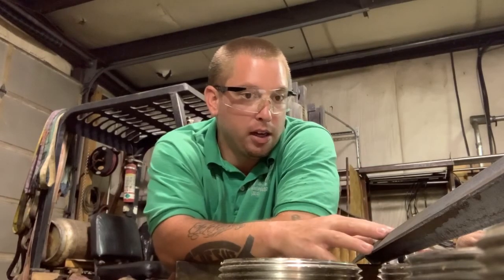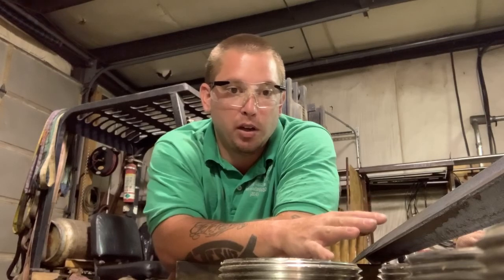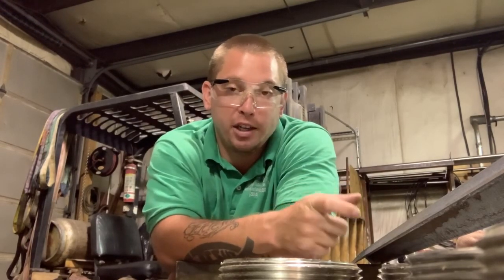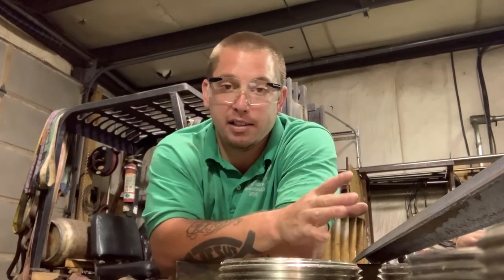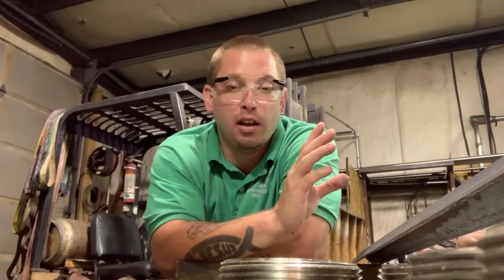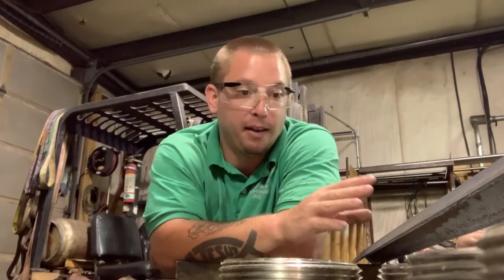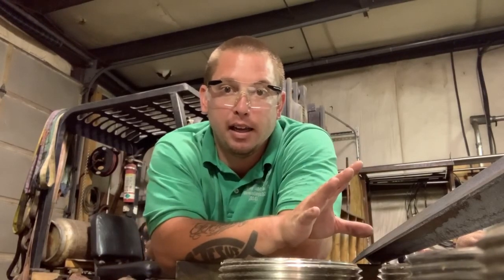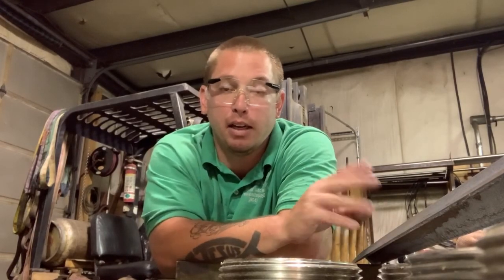And weld the top frame, the bottom frame, then get the legs cut and weld those on. Then we're going to have to make a plate for each leg to mount the casters on. I haven't gotten those yet, so that'll be the last thing. I'll have to get the casters and then see what tapped holes I have to do in that. After that, it's ready to paint, and once it's painted, we put the diamond plate back on, and then it's done.